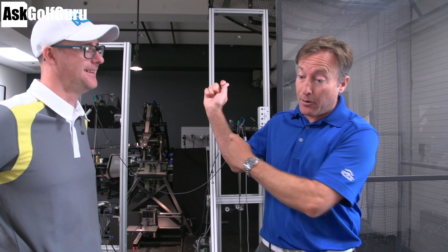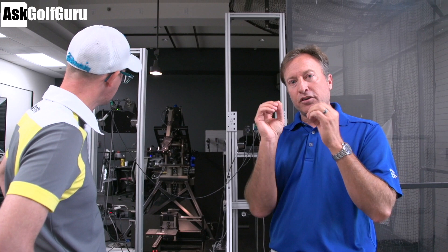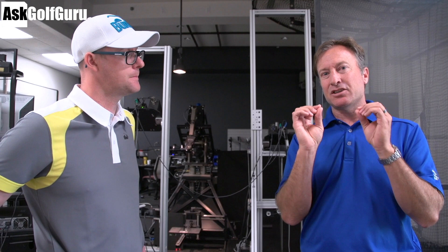The robot is, for all intents and purposes, stupid — it does not react to anything. It doesn't react to the shaft feel, the look, or the sound. It can deliver any attack angle, any path angle, within a tenth of a millimeter on hit location. We can set dynamic face angle and dynamic loft at impact. We can do accurate comparisons between last year's club and this year's prototype, and also compare our competitors' clubs — seeing where a competitor does certain things well and where there are weaknesses. We can also back up marketing claims legally: instead of needing 200,000 hits with human testers, the robot can do it in about 200 hits to reach statistical significance.